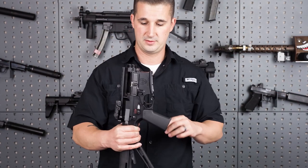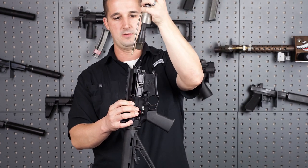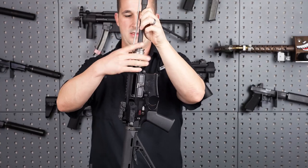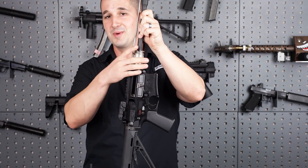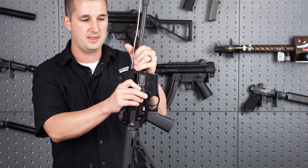To do this, make sure that the bolt carrier is locked back to the rear. Then you're going to want to insert the barrel into the receiver and ensure that the tab is in place. Go ahead and tighten down the barrel nut. As I said in my other videos, save for the Kavari, you do not need to use the supplied wrench to tighten this down — hand-tight is fine, but you can use it if you want to.